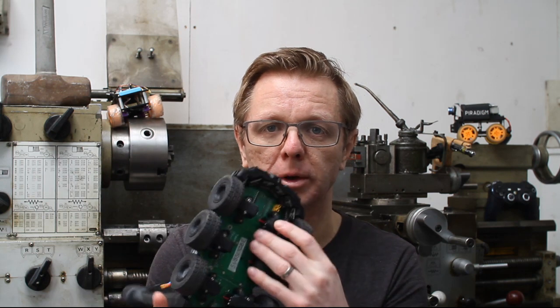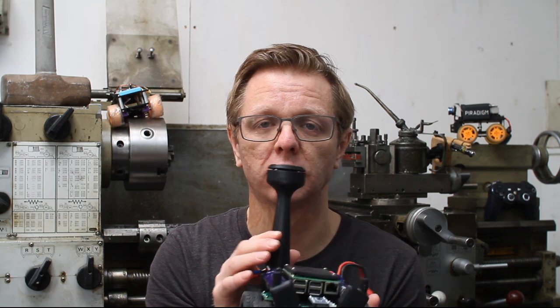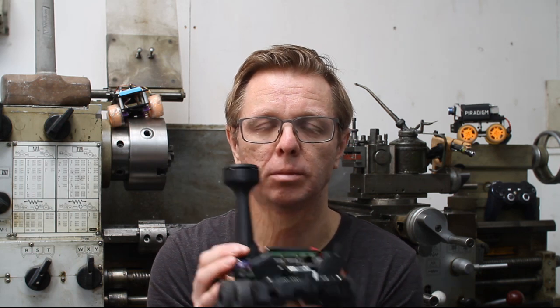We've put the magnetometer on this tower. Primarily that is to avoid the magnetic field from the motors. We've found in testing that they could interfere and reduce the sensitivity of the magnetometer. We use the magnetometer or electronic compass to give us our heading, so it gives us a really good insight into what direction the robot's pointing.